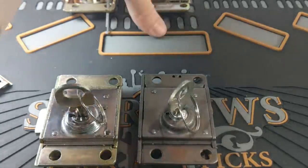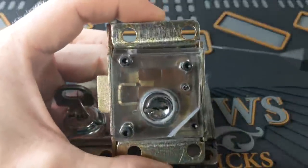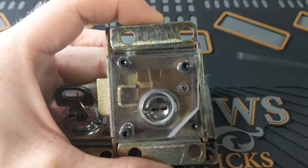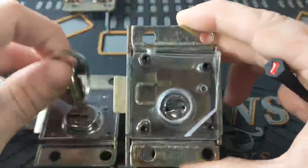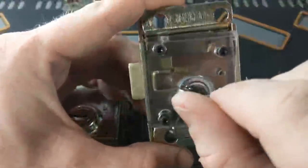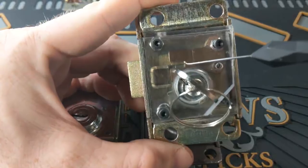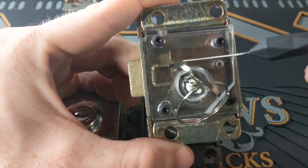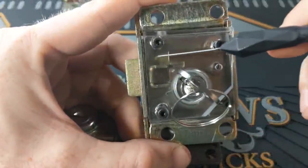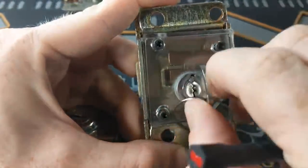And actually here, I have one here that has an acrylic face on it. So as you can see, there's no springs. You can't see much because of this copper plate here that guards the levers. But what you can see is when I turn the key, you can see all of those levers line up. And that silver part that you see in there is the stationary ward. So the fence also has a cutout to go past that ward and be able to open up.